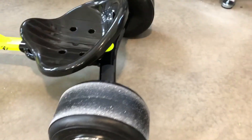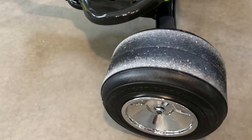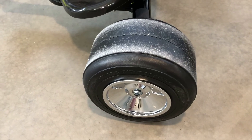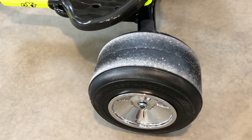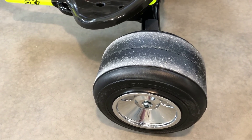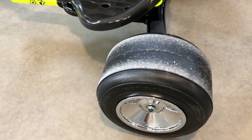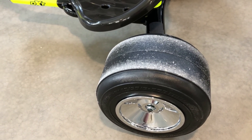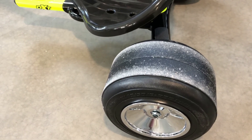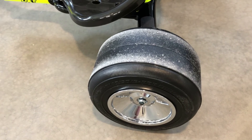The first will be to change out these back tires. These are hard plastic, they're built for drifting, which isn't a particularly useful attribute down in the crawl space. I think if I get a pneumatic or hard rubber tire, it'll run a lot quieter, a lot easier, and also if I get a smaller diameter, it might put the seat down a little closer to the floor, which hopefully will keep me from having to duck so much down there for the beams.